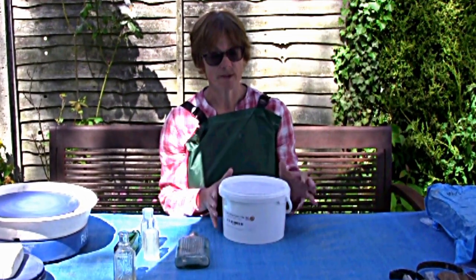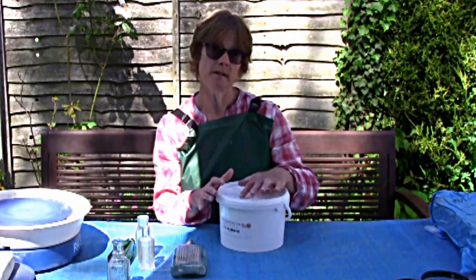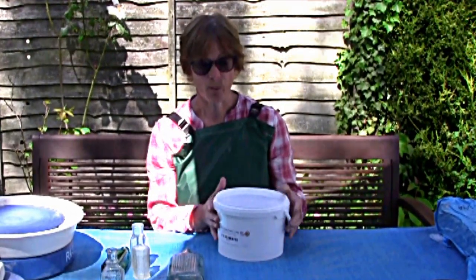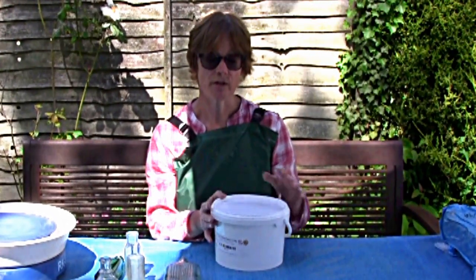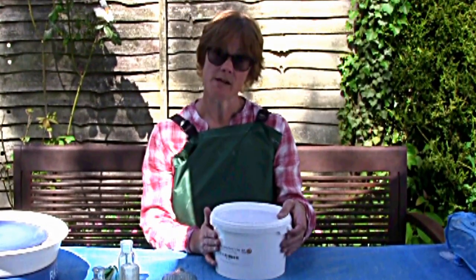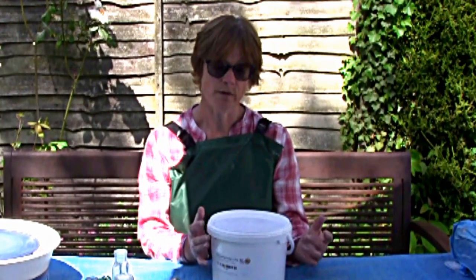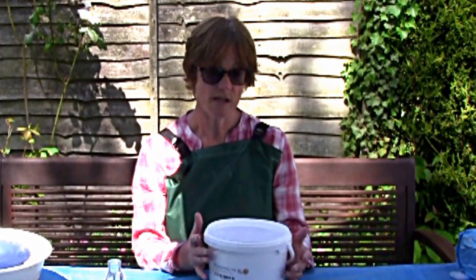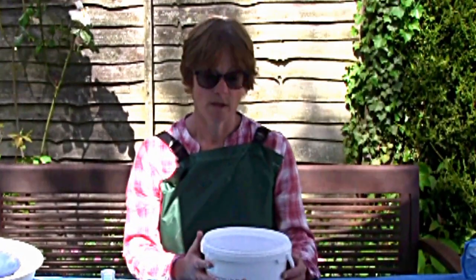The plaster that I'm going to be using is fine casting plaster, and it has to be in date. If it's old, it won't work. It doesn't seem to set properly and it doesn't heat up. You need that chemical reaction of it heating up. I've tried other plasters in the past and haven't had good results with it. And you'll find that if you have a builder's type plaster, that won't work. It's not any good. So a fine casting plaster is the best option.